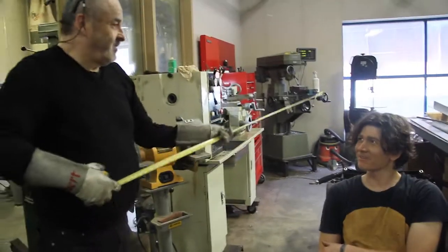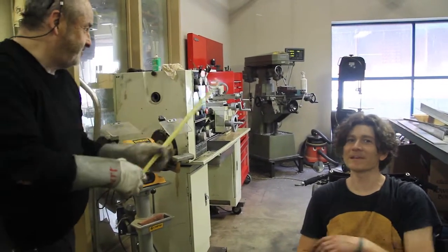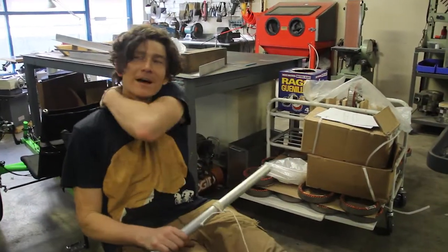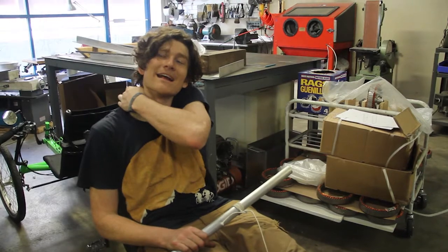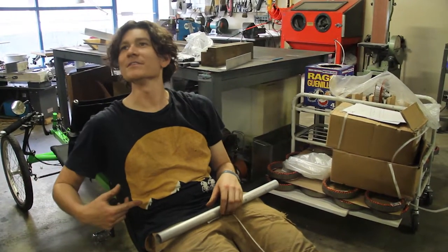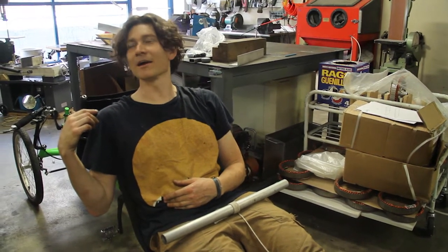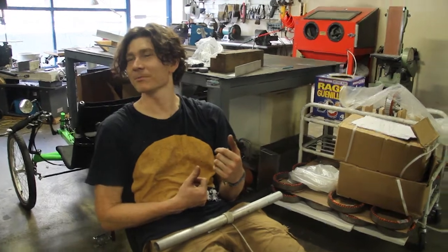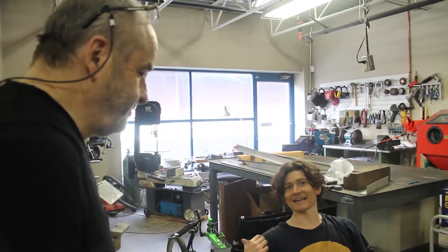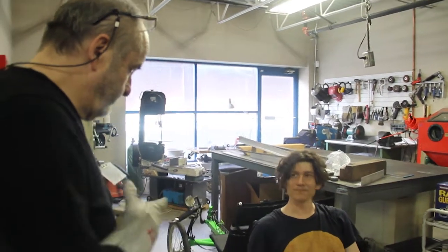Now we can compute properly about our drum diameter. The diameter of the drum needs to accommodate the string pull. I'm figuring that if I do this right, I'll be rowing at about 30 to 35 strokes per minute, so I can correlate 68 inches of string pull into a certain number of crank revolutions. For instance, if the pedal cadence is 80 RPM but I'm rowing at 30 strokes per minute, I'll want a drum size that does about two and a half turns.